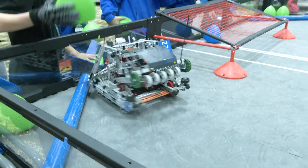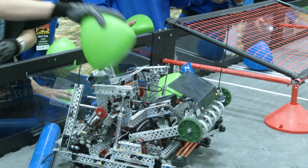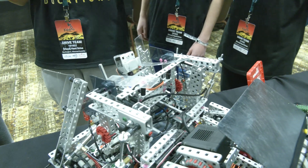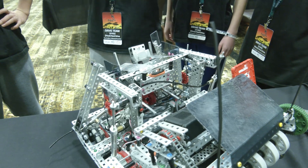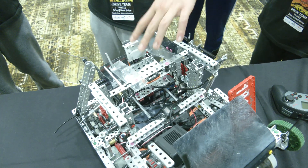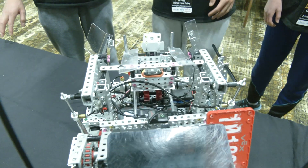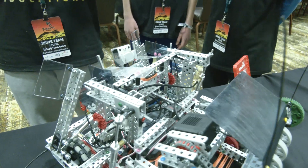Let's talk about your catapult. Watching on the field — very fast match loads, Oliver. Talk to me about your catapult in general and how quick you're getting through your match loads. So this catapult — we actually used to have a different one. This is technically more of a kicker, but it still works for catapults. Originally we were planning a catapult that would shoot the traditional way, with two standoffs where the tri-ball would be placed and hit. But we decided to change this design because it's quicker, more efficient, higher, and easier to match load. This catapult isn't the fastest but it's very accurate and shoots very far.